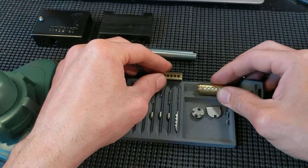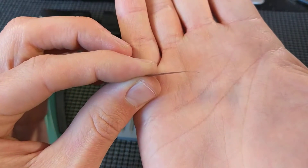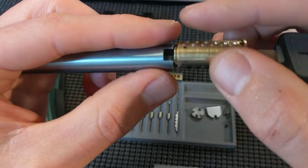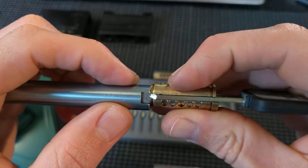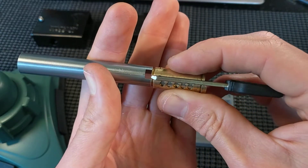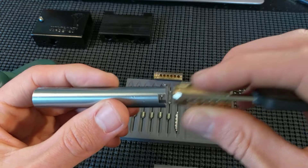The last piece is I'll be using a shim that's kind of bent down a little bit. You need the shim because there's a gap right there between the follower and the plug that the inner drivers can fall into.